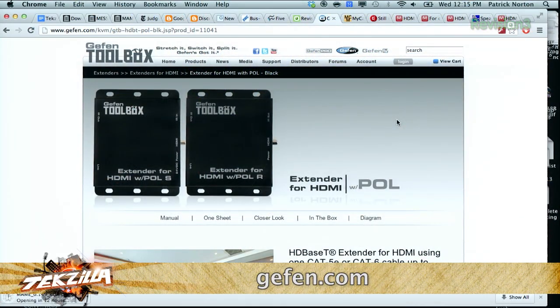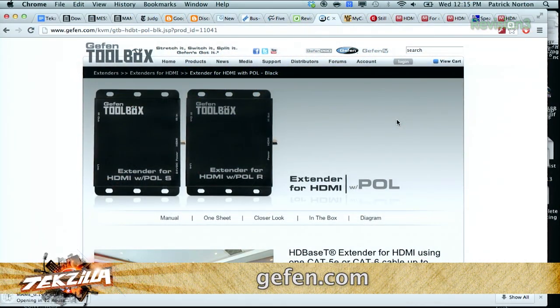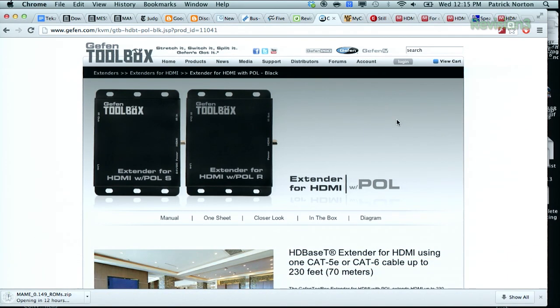Sure enough. We should point out — you said HDMI over Ethernet as in HDMI over Ethernet balun. They're commonly used for HDMI runs over 10 to 15 meters, say in a large home. If you're setting up a lot of televisions in a business like a hotel lobby, foyer, or a studio, they can have issues, but if you're careful with the cable, they usually work just fine. They're generally priced anywhere from $20 for a cheap no-brand to several hundred for Geffen's top of the line, which should be good for about 70 meters. It's a cheap way to do long extensions of HDMI because you can terminate an Ethernet cable yourself, which is really nice.